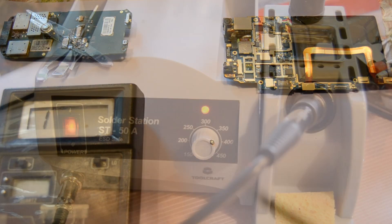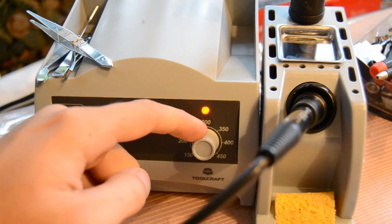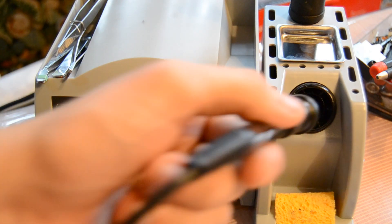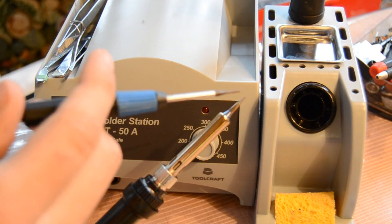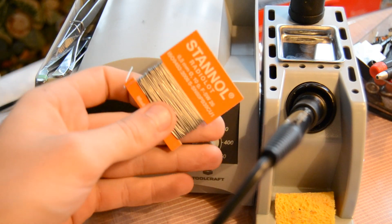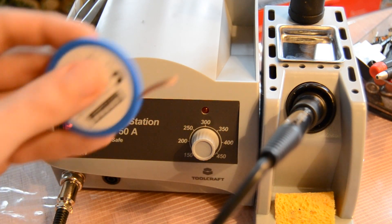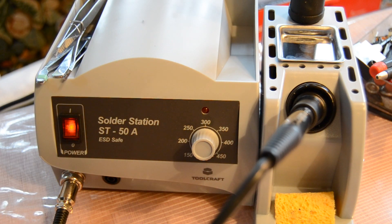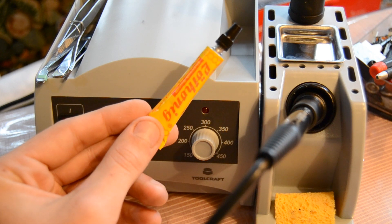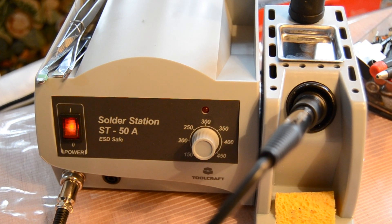Now I want to show you which equipment and skills you should have to replace such a coil. You should have at least basic soldering skills and a good soldering station with at least 30 watts and temperature up to 550 degrees. You should also have a pair of tweezers to handle the little coil, a good soldering tip of at least 0.3 millimeters — not too small or you can't get enough heat onto the coil. You should also have 0.5 millimeter solder which is good for SMD components, some solder wick to remove excessive solder, and some flux. I'm using soldering honey — it has the same consistency as honey — but you can use any flux you can get.